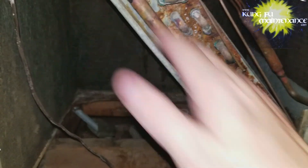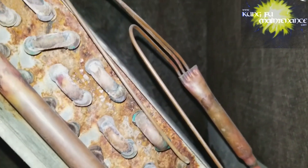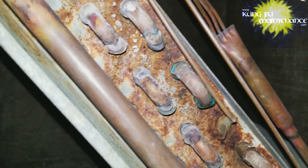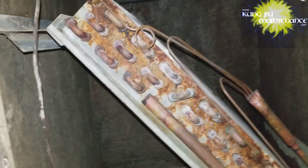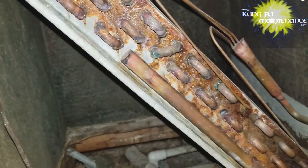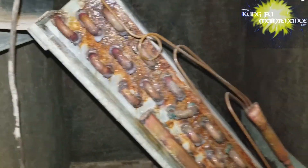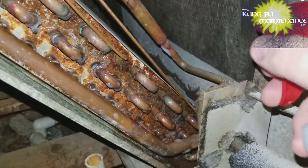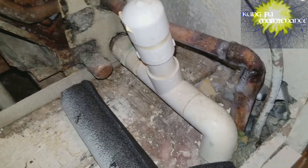Here's the slant coil. The capillary tube is the metering device for this unit — we're going to be getting into the different types of metering devices in upcoming videos. You can see the coil and the conditions it's in. Most of your leaks occur at the Schrader valves, but the second point is the evaporator coil. You can see the conditions it's in — it gets wet, it gets rust. Most of the time a leak is at the Schrader valves, and then this is the second most often place. I don't see anything there. Check the solder joints — those are likely suspects.